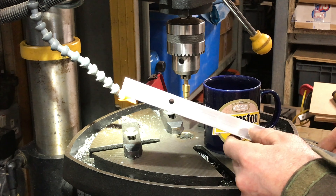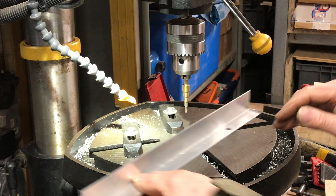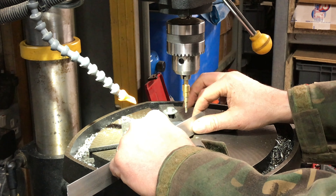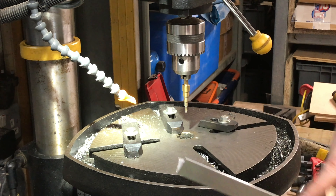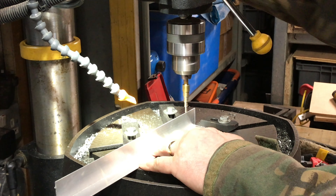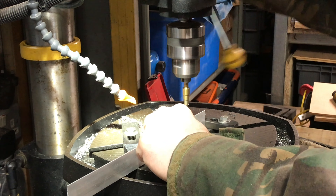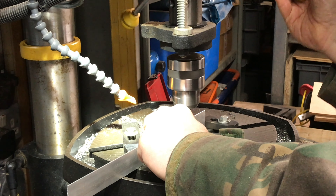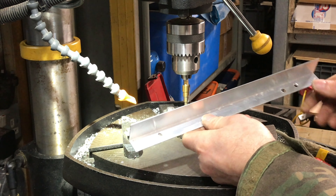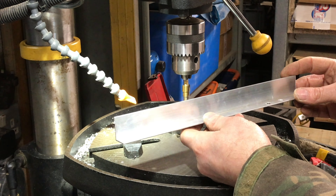Time to drill the rails - there are over 32 of them, each with a hole in them, so a lot of holes to drill. I've set up some backstops on the drill press so I can just slide the plate in, hold it, knock the hole in, turn the plate round, and carry on through the process. That should speed things up so I don't have to measure each individual rail. The holes are going to be in the same place every time on every one of those rails. There are existing holes already in the metal but I've avoided those.